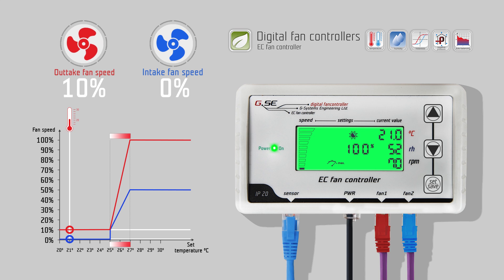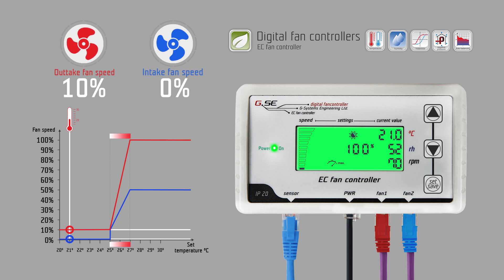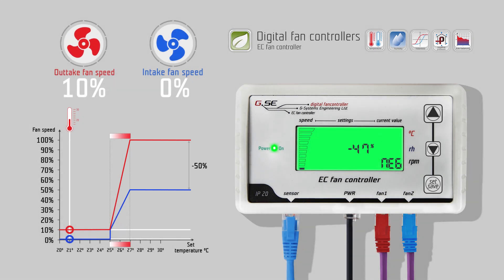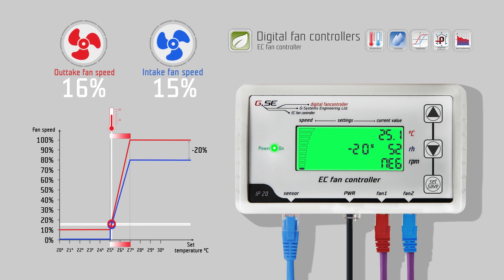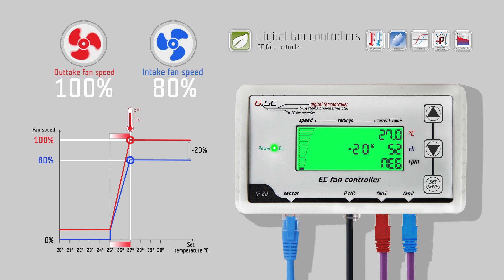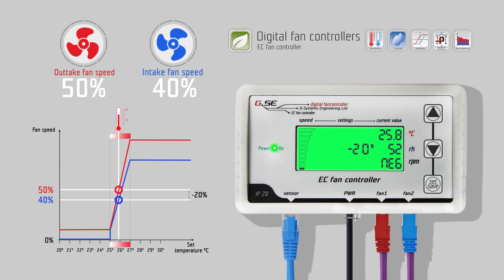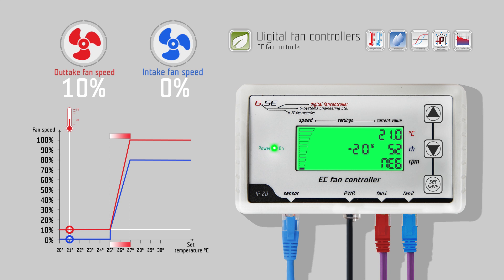The LED indicates the state of the fans with a constant shine during daytime. During night time, the LED is blinking and the controller uses the next 6 settings, which are set the same way. After you have gone through all of them, press down again to set the negative pressure setting. The negative pressure decreases the speed of the intake fan. For example, we set the value to minus 20%. When the exhaust fan operates at full load (100%), the intake fan stays at 80%. If the exhaust fan runs at 50%, the intake fan runs at 40% — minus 20% of its power. The exhaust fan removes more air from the room than the intake fan blows inside, and you obtain a guaranteed negative pressure during the regulation.